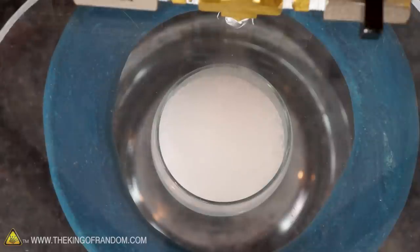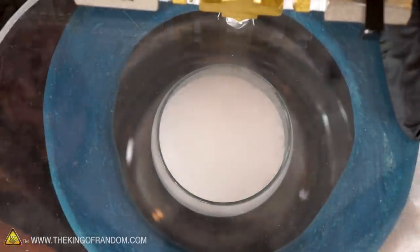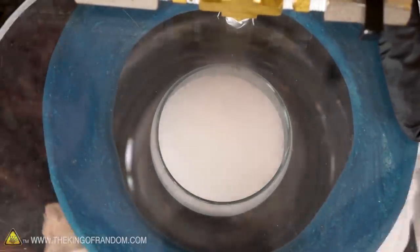Watch what happens if I close this valve and turn off the pump. You can see it maintains a vacuum pressure. If I wipe this down so you can get a better look, you can see it still stays in its snowy state as long as there's a little bit of pressure. But remember, the nitrogen is still warming up, and as it warms up it's going to release gas, which increases the pressure, which is going to make this thing liquefy over time. You can already see it starting to warm up — the liquid is starting to boil at the bottom again. This is with nothing happening; the vacuum pump's not running, I'm not letting any air in — this is just it sitting by itself.